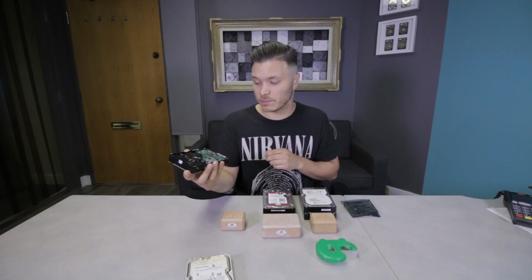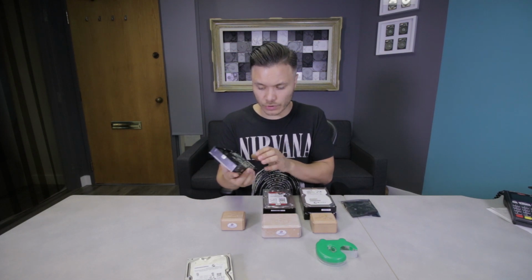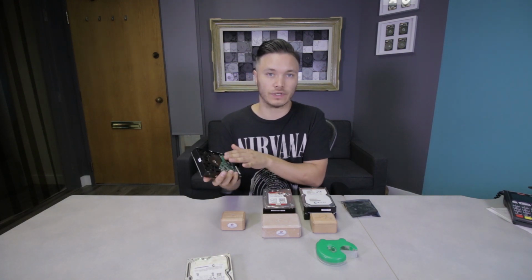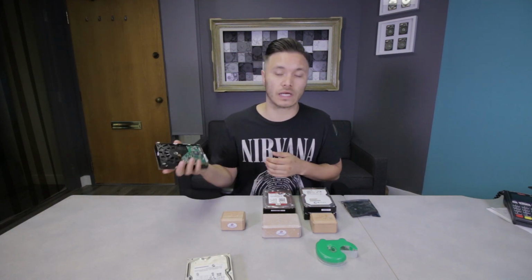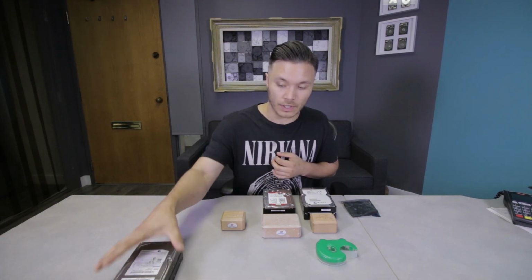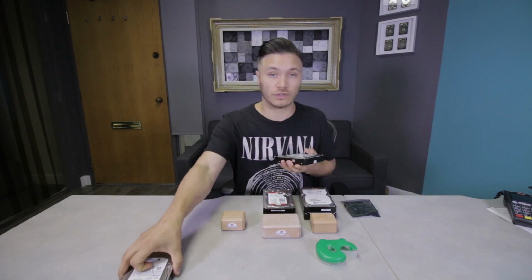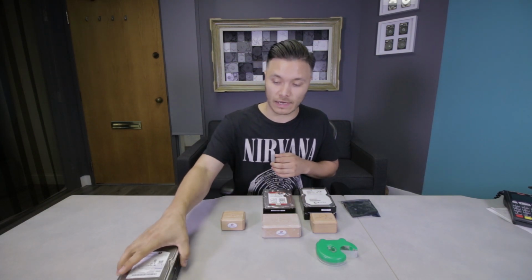This drive, however, does not spin up, and I've tested it through several things, including the board swap, which was the easiest to tackle. But one way to kind of simulate the problem, I put an isolator to the head assembly and I powered on the drive so that it would feed the power to the motor, and it's not doing that. So I would assume that if it's not rotating, the problem is not on the ROM level or PCB firmware corruption level, because I took this board off of the failed drive and I put it on the donor and the donor rotates. So it's simply something within the motor and we'll have to deal with it.